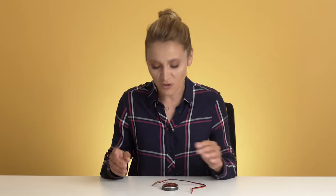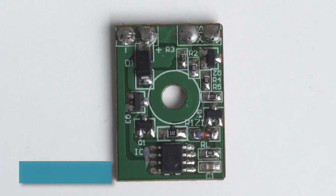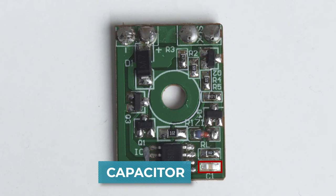The only control we have here is probably this capacitor, between legs 3 and 4 — and for some reason, upside down. This should control the timing of the siren. When it is on, VDD high, all six sequences are played one after the other, then the circuit restarts and plays from the very beginning. There is not much that you can do — there is no control. If you think differently, let us know in the comments. The only way I see it is to cut the siren driver from the speaker and connect your own solution.